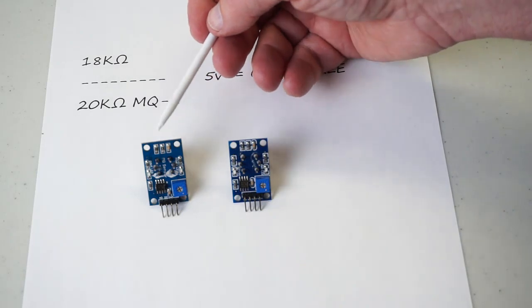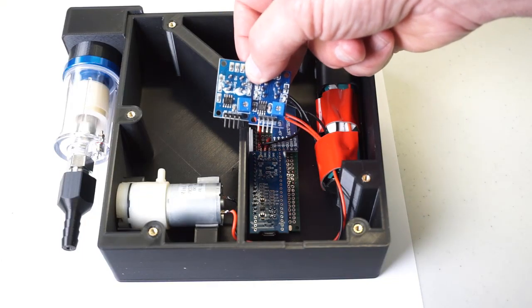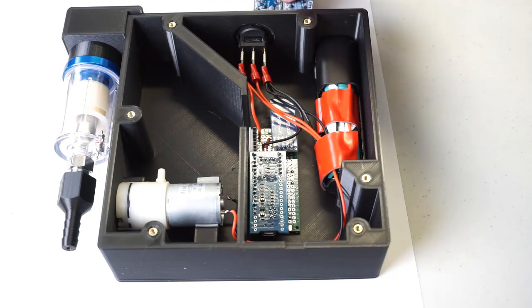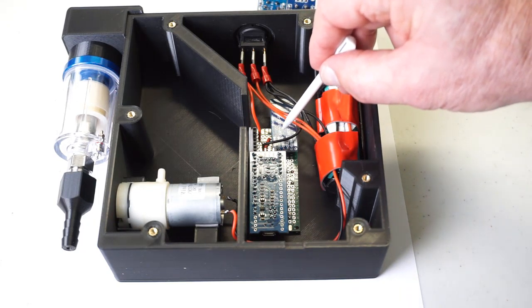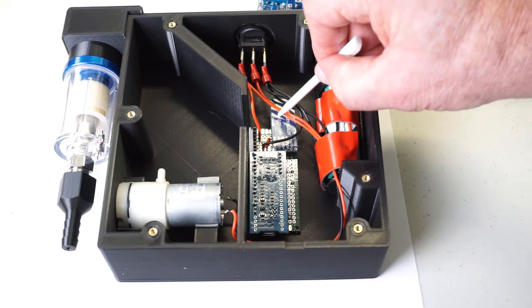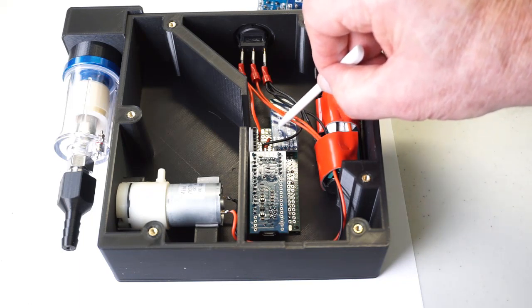And not only did I salvage the board, but I was able to confirm everything that I've just presented to you here. Unfortunately, it seems to be like part of the sport, right? We get these things shipped to us from around the world at unbelievably low prices, but every once in a while, there's a dud in there. I've alerted you to the same thing with the STM32F103. I've had some bad ones come in. And the HC-06 Bluetooth module is a real bugger for that too. So keep an eye. Try to look for the ZS-040 when you order a Bluetooth module. I've had more luck if that designation was on the back of the board.